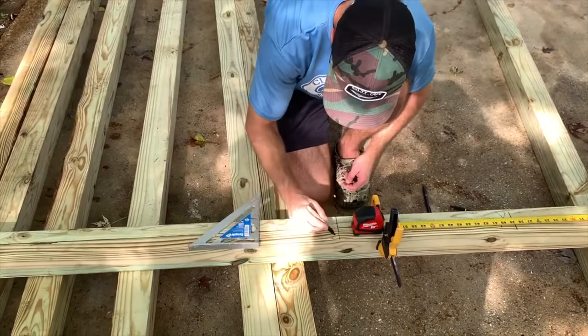Now the manufacturer includes a small lip on the window's mounting flange, and this lip shows you exactly where you're going to install the trim around the window. Make sure the flashing tape at the top doesn't go any further down than that lip.